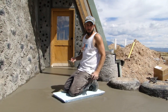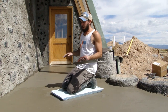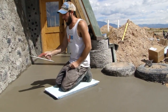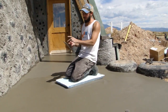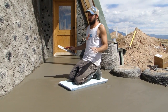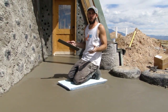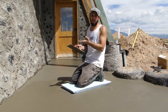This narrow pour is screeded and it's had a little time to set, so we're troweling with a magnesium trowel over the screed. What that's doing — magnesium is non-magnetic — so as we go over it, it's pushing the aggregate down and pulling the cream, the liquid from the concrete, up, but it's not pulling the aggregate back up because it's non-magnetic.